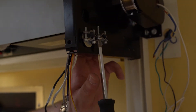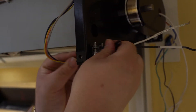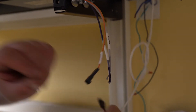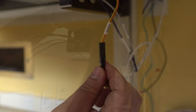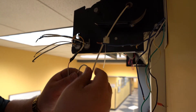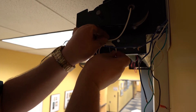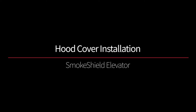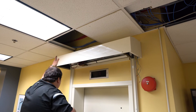Then you will wire the egress switch wires. You will start by feeding the incoming wiring and the egress and alarm contact wiring through separate wire clamp connectors. You will use the incoming wiring later, but you will make the egress connection now. Secure any loose wires using the provided cable ties. You can now reinstall the hood with five number 10 screws as shown.